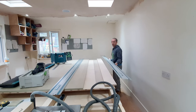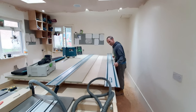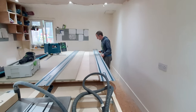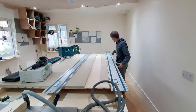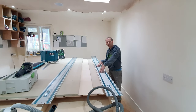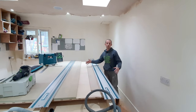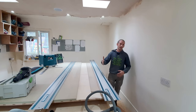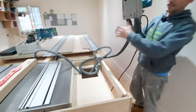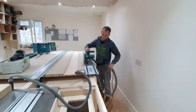I'm going to place that on a scrap of birch and just skim maybe 10mm off, give or take. That will be our reference cut - we know when we cut that it's going to be as straight as an arrow. This bench is completely flat and level, there's nothing wrong with it, so that cut is as good as it's going to get because it's got no joints. I'll get my saw, which is already set at the right depth.